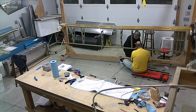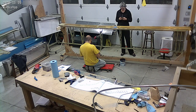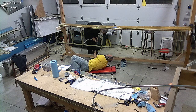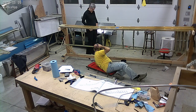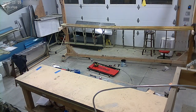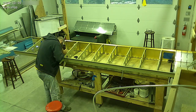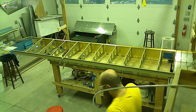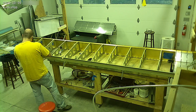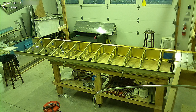And I'm going to be drilling them to size and deburring everything and cleaning it all up and dimpling them, fay priming them, which is going to be different from the rest of the priming. Fay priming is where you prime only the surfaces that get other metal on them — basically along the ribs on the skin. And then we're going to put those away and they're probably going to sit in storage for a year, but they'll be done.